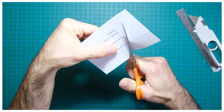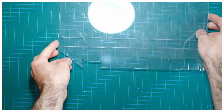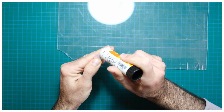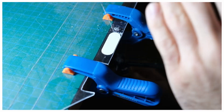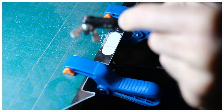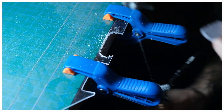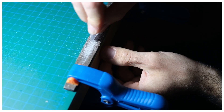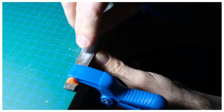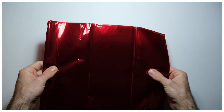For the red window on the back of the camera, I'm also using a paper template to cut a 2mm methacrylate sheet. The templates for the foam and the window are available in Printables and must be printed at 100% scale. A transparent red film is used in addition to the methacrylate to reduce the most harmful light wavelengths entering the camera.